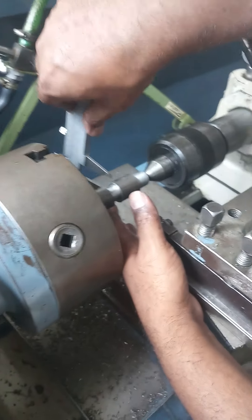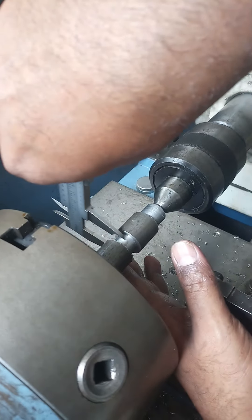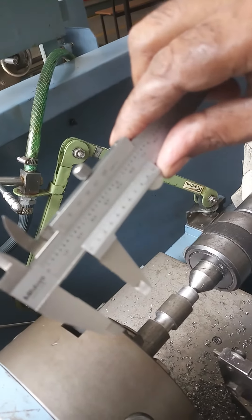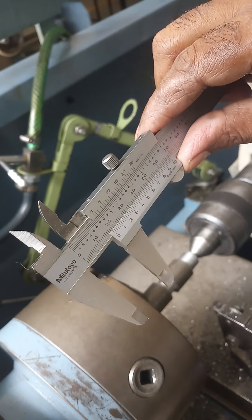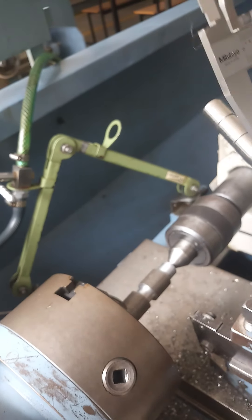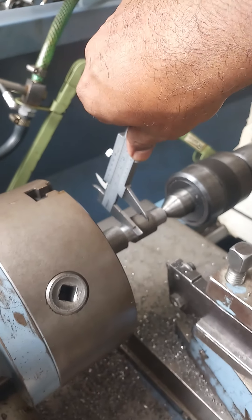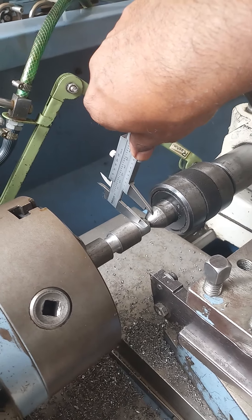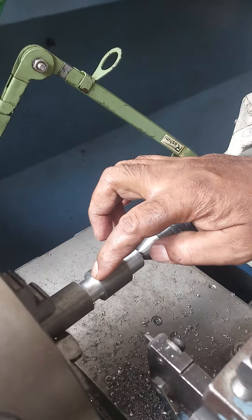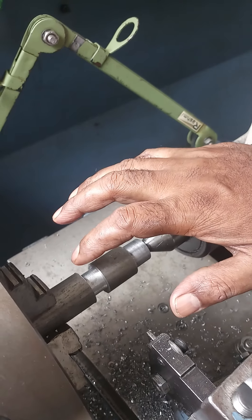In the same way you have to check the diameter. It must be exactly 19mm. Right now it is still minus around 0.5 — the tolerance is plus or minus 0.5. So after completion of the undercutting portion, the dimensions are: length 25mm, width 10mm, and diameter 19 plus or minus 0.5mm.